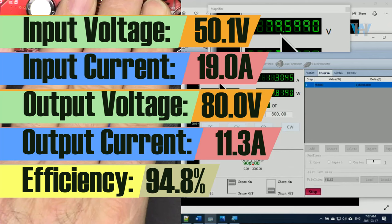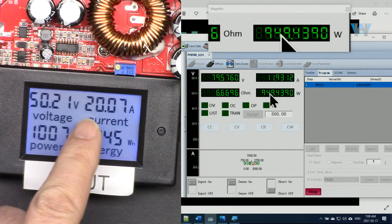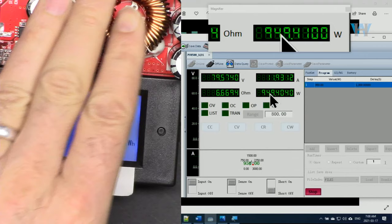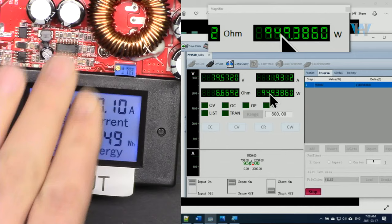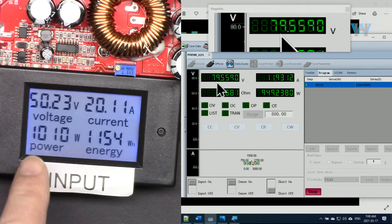Now let's go with 950 watts. The input current is at maximum — 20 ampere. So this cannot handle more based on the specifications. They say if you're using it above 15 ampere you should add extra heatsink or fan, which this one does not have, but it can handle 950 watts at 20 ampere. The output is 950 watts at 80 volts, input is 1010 watts.